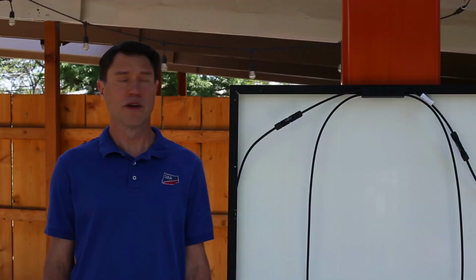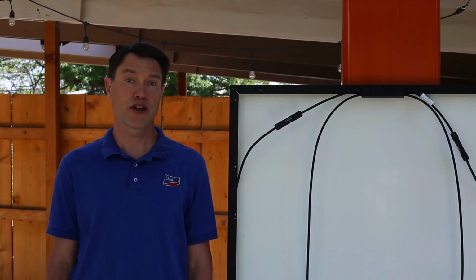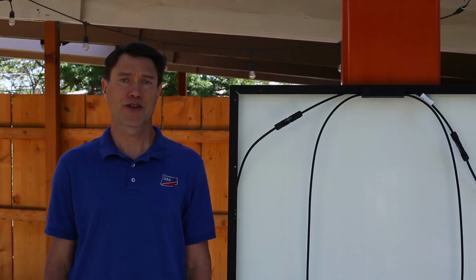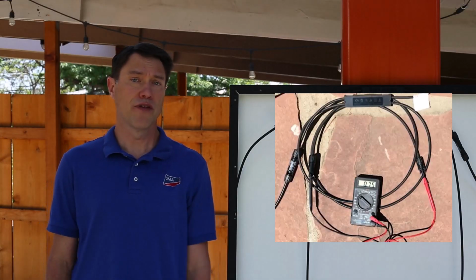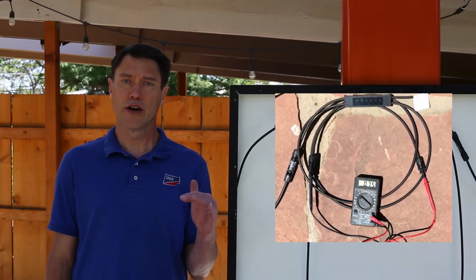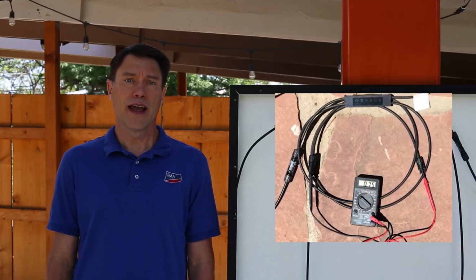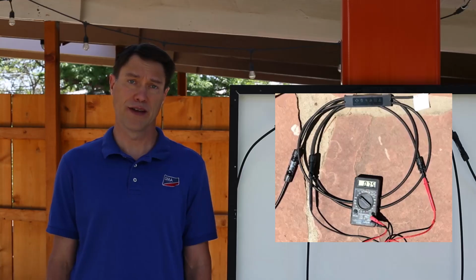It's important to remember that the receiver will stay in shutdown mode until it receives the keep alive or permission to operate signal from the SunSpec certified transmitter in the inverter. That is, independent of the VOC of the module, until the device receives the keep alive signal, it will remain at a very low voltage. The APsmart RSD-S-PLC has a shutdown voltage of between 0.6 and 1.0 volts DC.